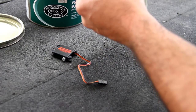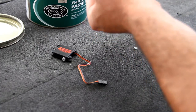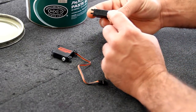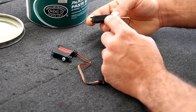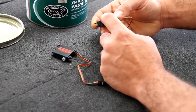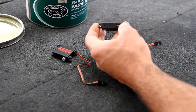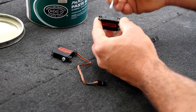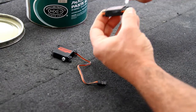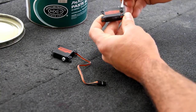You don't have to worry about polishing out this wax — it's not like we're laying up parts in a mold. An important thing is to make sure you get plenty of wax in the nooks and crannies near where the screws are, around the screw head, and in any indents in the servo case. You don't want any resin going in here and trapping the servo. I take a q-tip with a little wax and just push it into all those little cracks.